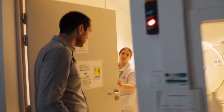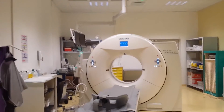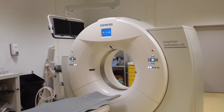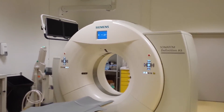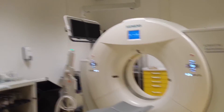So this is the scanner. It is causing all the radiation into the 900 megahertz spectrum. Every time this machine is switched on, it fires out a whole load of noise which our system was picking up and which we had to filter out.